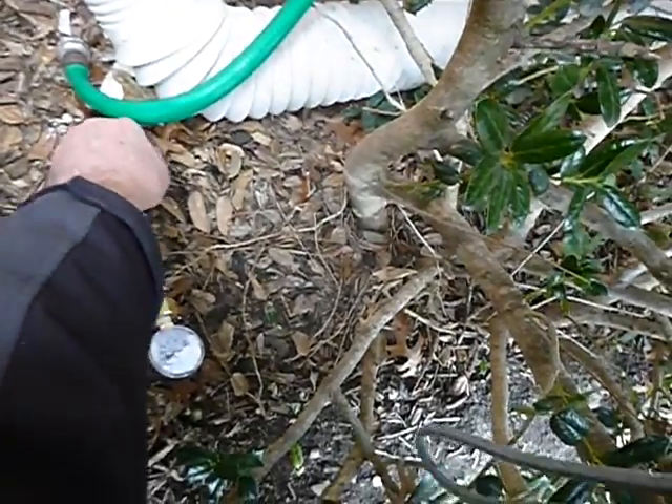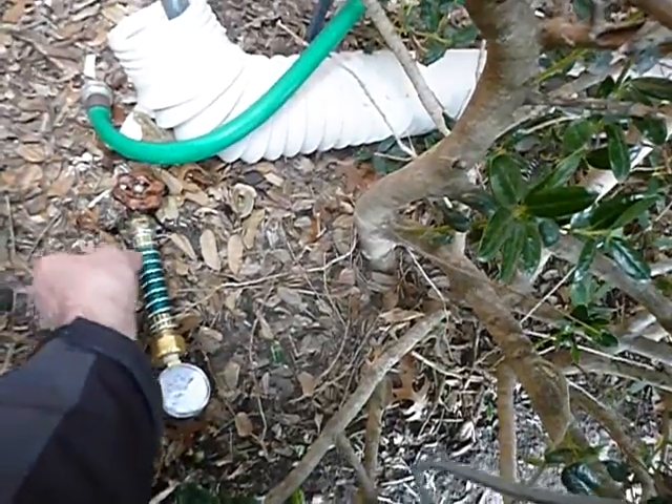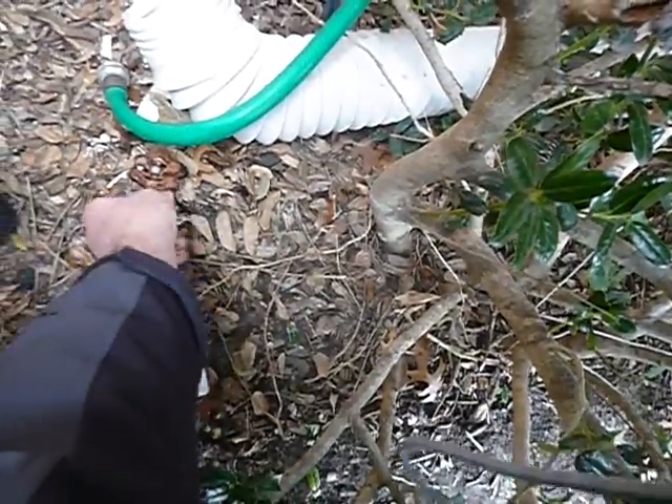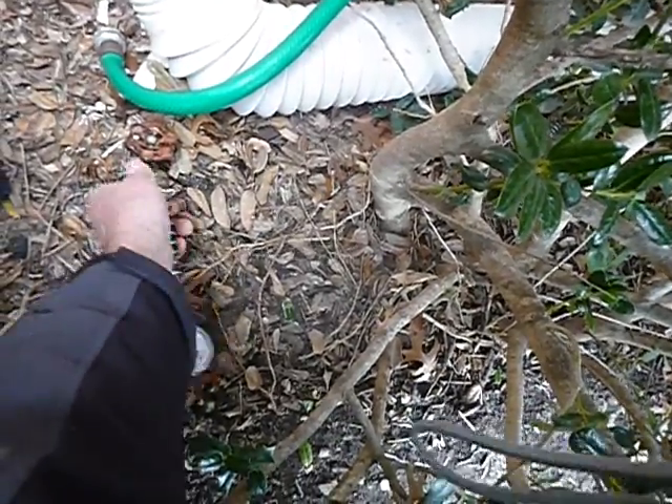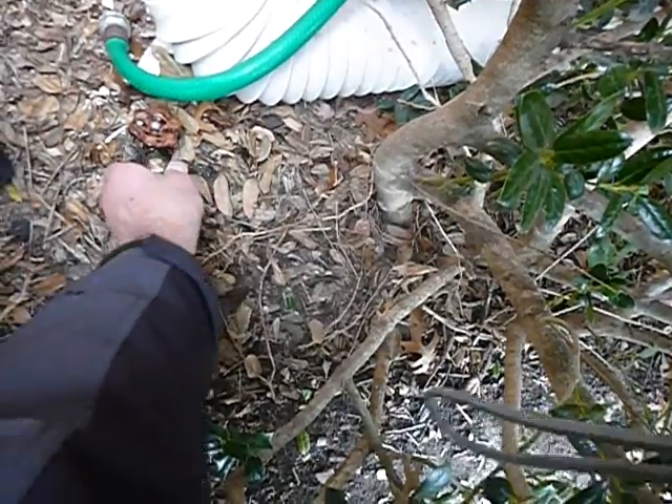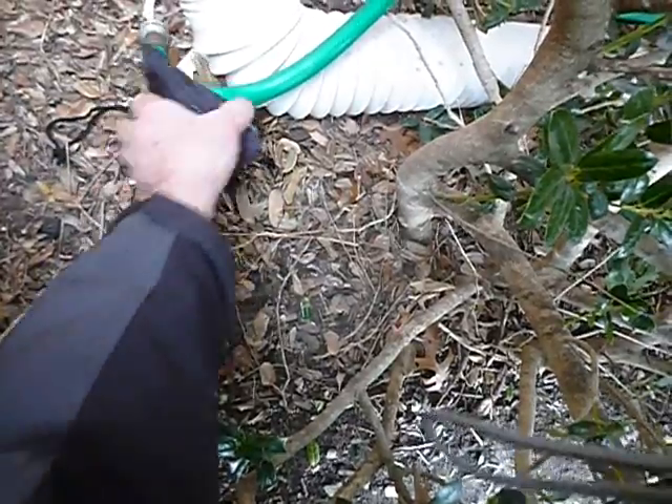Usually around here I see some rods coming up out of the ground as the main water shutoff valve to the house, unlike the main water shutoff valve to the lawn sprinkler system. In a lot of cases I just can't find them. I'm not seeing a main water shutoff valve. It's not unusual for a house of this age in this geographic region to also be missing a main sewer cleanout. So the main water shutoff valve and the main sewer cleanout are not present — not apparent, not visible.